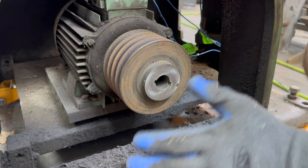These covers had some sort of paper seal on them, and there's no saving that, so I'm going to have to come up with a solution for making a new seal later on. Paint stripping for these parts was the same as it's been, and it went pretty smooth, although after a while, I got kind of tired of it. So I decided to drop these parts in the ultrasonic cleaner and let it go for a little while to soften it up even more.